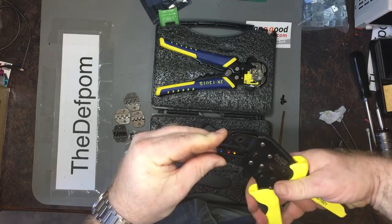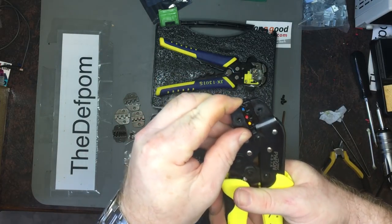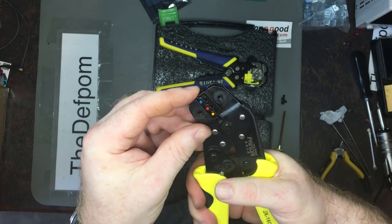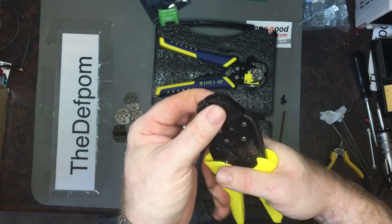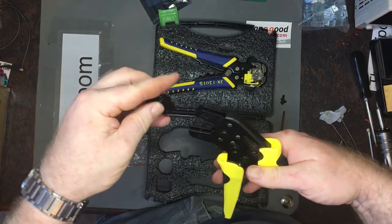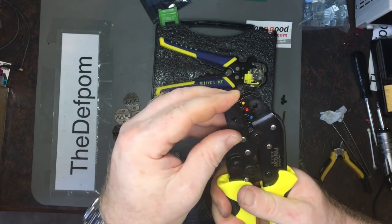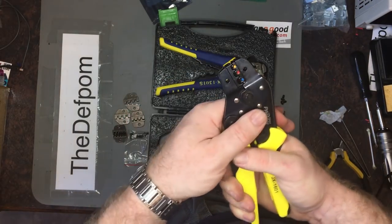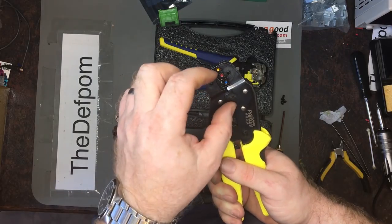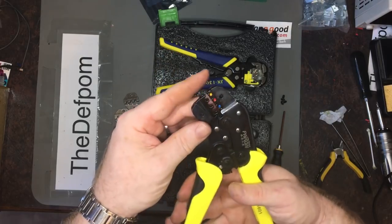So I don't know, maybe it's correct, I don't know, but I do go in. Are they the correct way around? Probably not. They were trying to push outwards, so let me just swap them around. Yeah, that's better. Those line up now. Which is the way you expect them to be, the biggest one closest to the hinge point for the most leverage and crimping power.